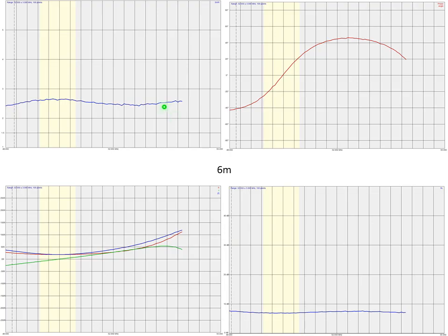And finally 6 meters, I run out of gas on my analyzer here at about 54 megahertz, I think it is. Here the SWR is higher than we've seen typically on the other bands, about 2.5. So this could still operate very well without a tuner, but if you use the internal tuner, it helps that out quite a bit. And you can see this is the lowest of the return losses that we've seen, probably about 8 dB.